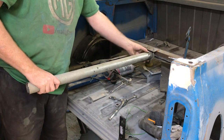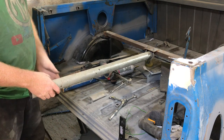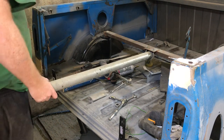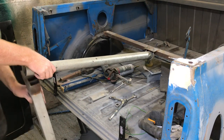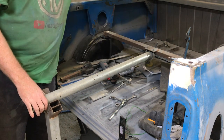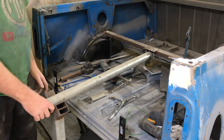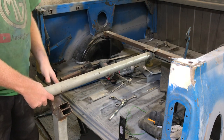One thing I'm going to do is clamp it on there, maybe even weld it, and then this bowl will come out. If you just put that on a support like I had before, you've got no strength there — it'll just snap. If you had a long pole through the middle all the way to the front, you've got the strength of the pole. So we need to triangulate this bit here to make it solid back onto the car.